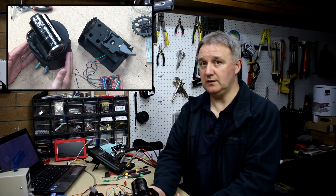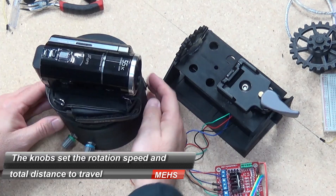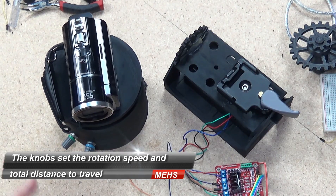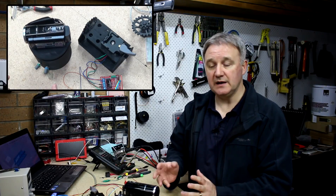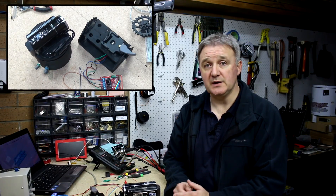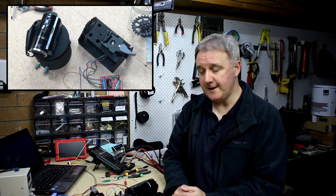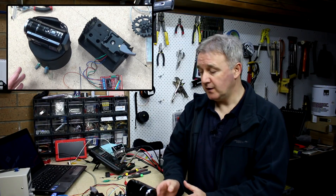As an example, the turret component — the midsection of this three-section camera dolly — has 5400 steps. When I turn this one on at maximum speed, it is nice and smooth. That smoothness is retained whether I'm doing a rotation in 15 seconds or in a much slower speed of around five minutes, which are the upper and lower limits of that particular section.